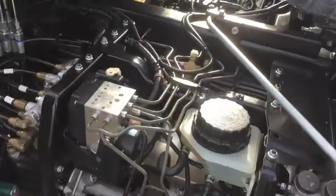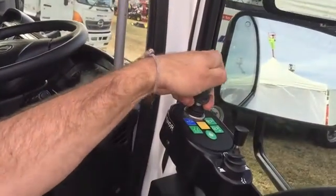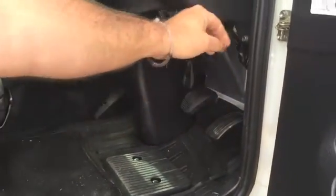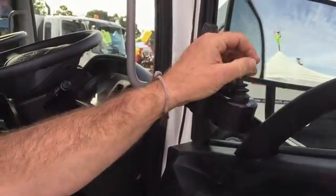When we get to our sweep site, we stop the truck, we apply the handbrake, we put the foot on the clutch, we engage the hydrostatic system, put the truck into 6th gear, lift the foot off the clutch. We don't touch the clutch, it's not a manual anymore. What we do then, we come to the pod. This is the right hand side. Obviously in Australia we spend 95% of our time on the left. This stick here, forward, reverse, and that's all you use to work the sweeper. You can use your throttle for your speed, and it'll run up to about 35 k an hour, maybe 38, and then you basically got your sweep control system there. Very simple. The whole thing works off this.